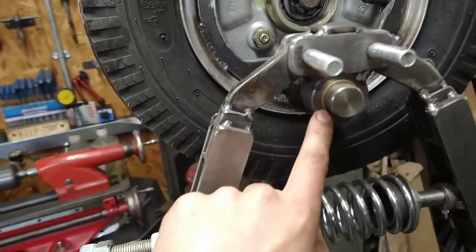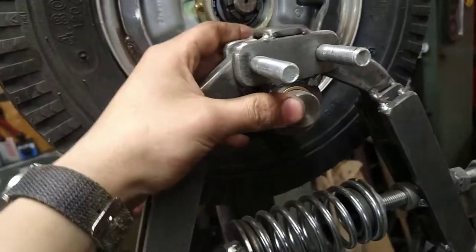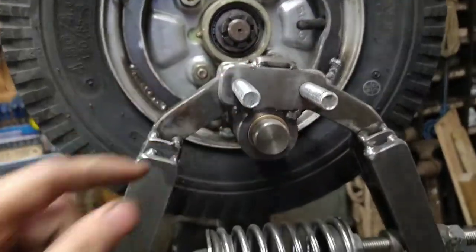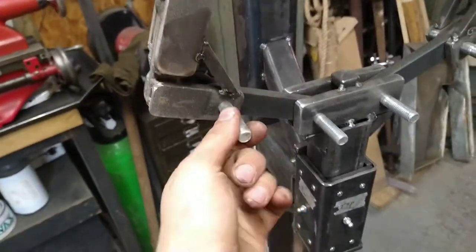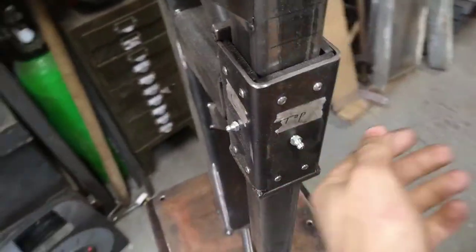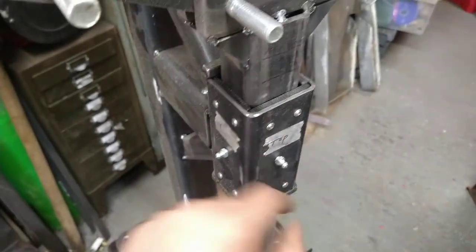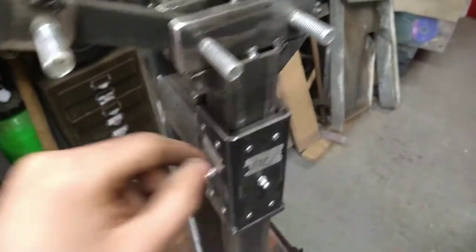So I made this piece anyway - this is an oilite bush in there. Solid bar that was bored out to the shaft - that's 25mm. I had originally bought oilite bushes for all these, but I figured with it being like a prototype I wasn't going to fully commit. If I'm happy with it and it works well, I'll just drill them out and press them in. I've still got them. Here I've used three grease nipples, and inside here I've got Delrin, which is like a wear plate, held in with these screws. There's a tiny bit of play, but that can be removed if you wanted to by shimming it out.